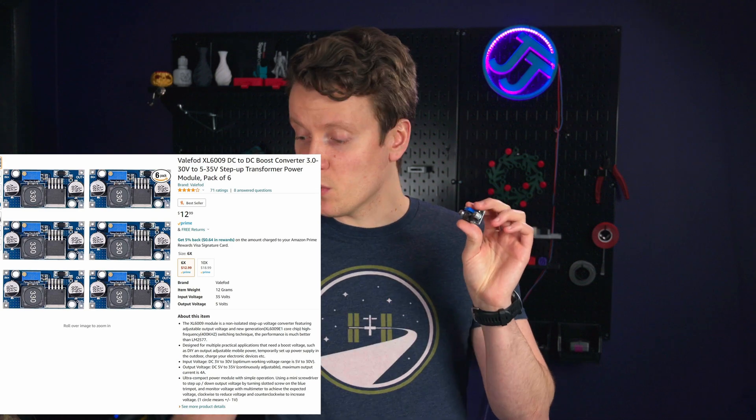I spent all week trying different configurations. I ordered a pack of identical voltage boosters — all the components on this board are identical to the burned-out ones. Even when wired correctly and tuned to 24V output, when you start heating up the hotend, it drags the output voltage almost all the way back down to 12V. I tried a large fan to keep components cool, tried three different boosters in case one was bad, and after the third one I was done — we're going back to the original V6 hotend, and this has to be a negative review.